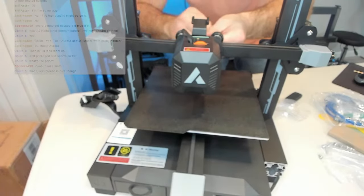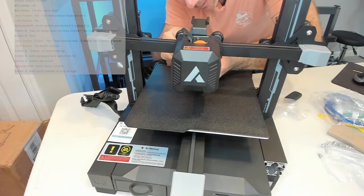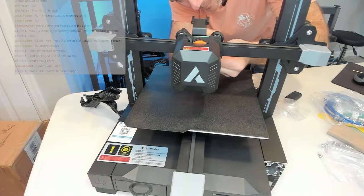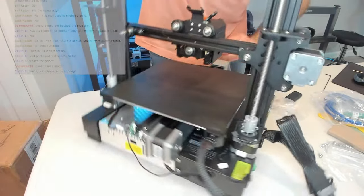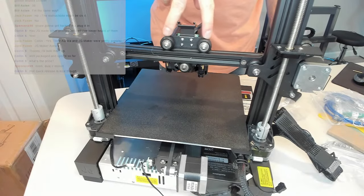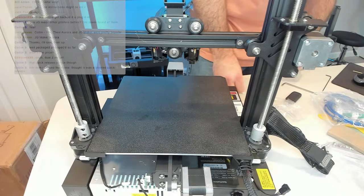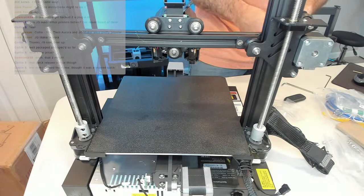That screw just stripped. And now let's go ahead and tighten up this eccentric nut while we're down here too. All right. So, eccentric nut. Two wheels right here that just have guides between the wheel and the rail. This down here has an eccentric nut. Eccentric meaning it's like an oblong circle. The more we rotate it, the closer the wheel comes to the rail. And then if we keep rotating it, it starts to release itself from the rail.